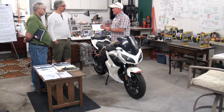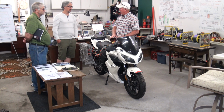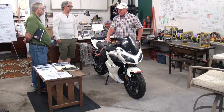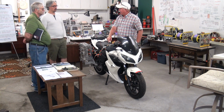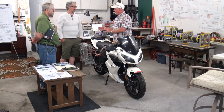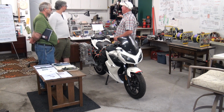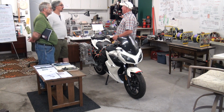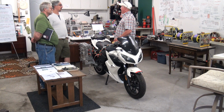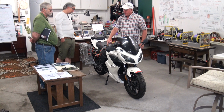The regenerative acceleration coil is connected through a bridge rectifier to the batteries. So what you're going to see on here is the magnitude of current that I'm delivering to the batteries. And these coils all create acceleration, whereas I purposely made some of those create deceleration so that you could see that if you put a conventional coil in there, it's going to decelerate the system.